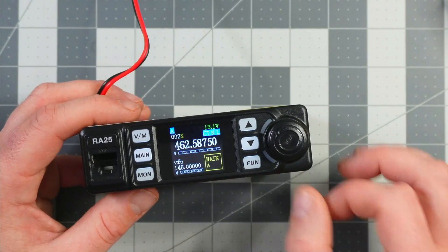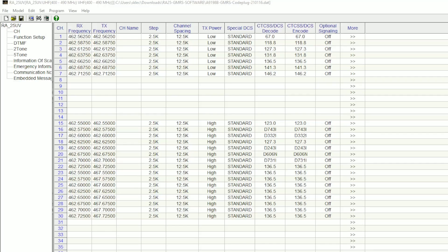So what's the problem? Let's go look at the computer. This is the code plug — the list of channel information for GMRS that's in the radio — and there are a lot of problems with it. I believe the channel spacing is wrong, and there are tones enabled where tones really don't need to be. Furthermore, you can't change much of this: I can't change the channel spacing, I can't change the power settings, and the CTCSS tones are enabled by default when they shouldn't be. My thought was: why should a consumer purchase a radio that's not capable of fully functioning out of the box?